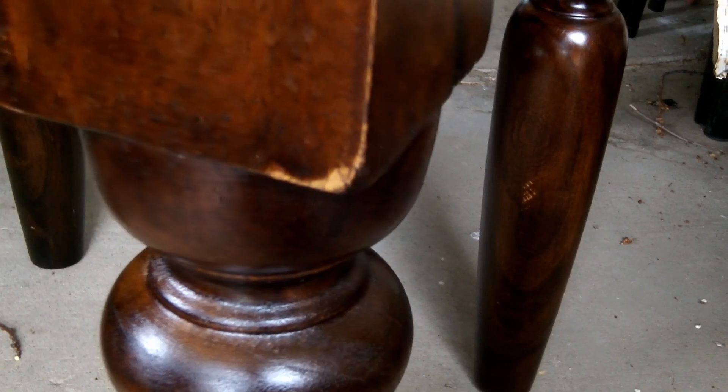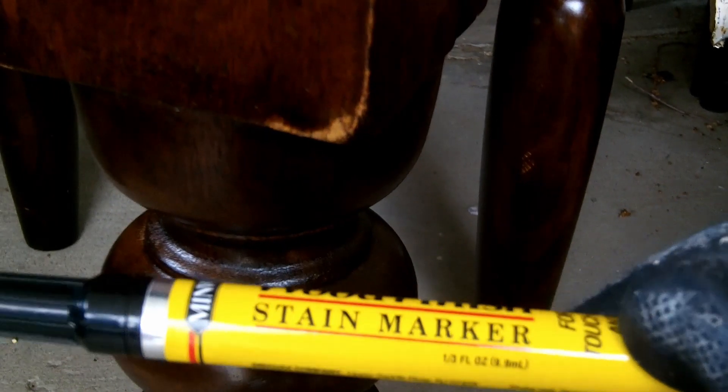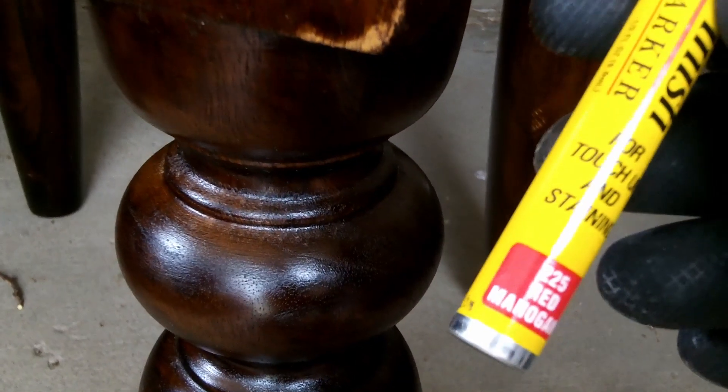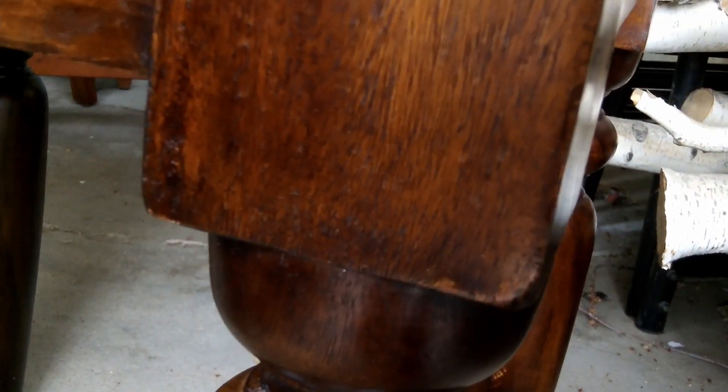There are some damages on the legs and I'm going to use a little wood finish marker — also red mahogany. I didn't need to get vintage burgundy to add more color to the legs; thankfully this was enough to cover it up. These little markers are really easy for detailed touch-ups, but just be sure that after you apply your touch-up you go back and wipe the residue off, otherwise you'll have a blob caked onto your furniture where you've been fixing the scratch marks.